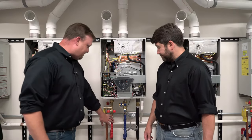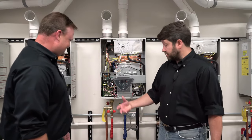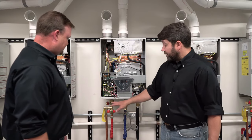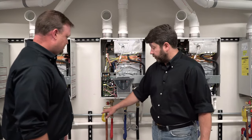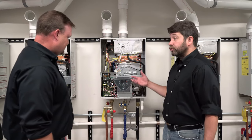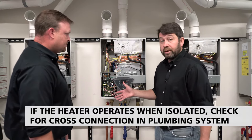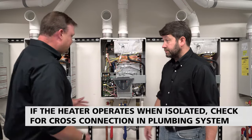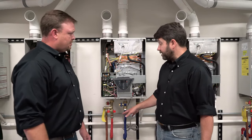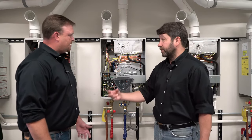It's easy for us because we've got red and blue color-coded connections here to make it easy — but that goes to show exactly how easy it is to accidentally get them reversed. Once we get flow going through the water heater, and flow is either coming out of our pressure relief valve or our service port, the water heater should come on and operate. If it does come on and operate with isolated flow, we know the water heater is working correctly, and the issue could be something downstream — a cross-connection or a missing check valve that was allowing water to bypass the heater.